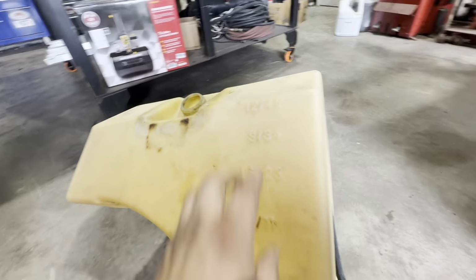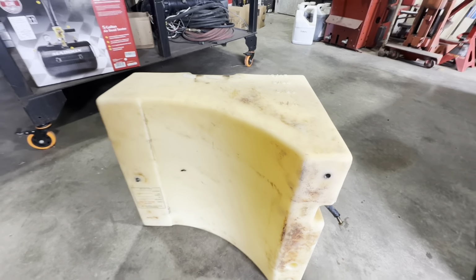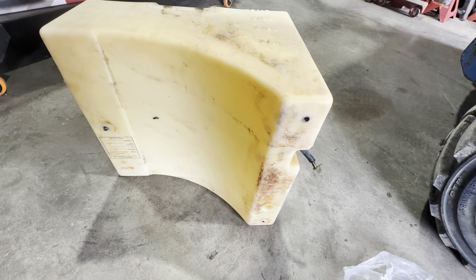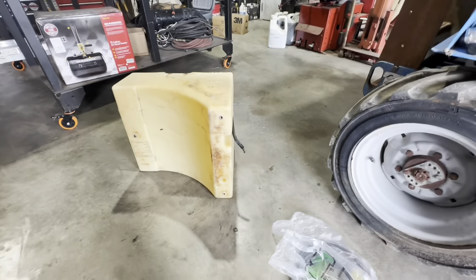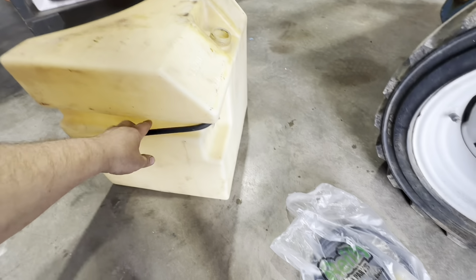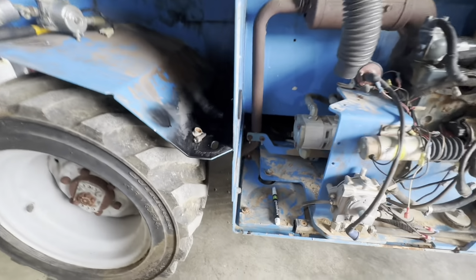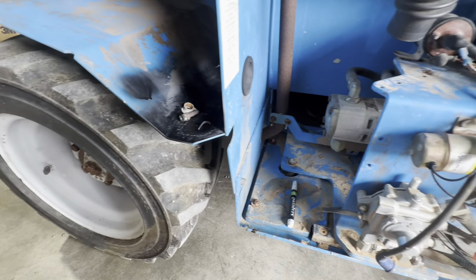And I tried fresh gas, pressure washer, degreaser, all kinds of stuff to clean that varnish out of here, and nothing would break it down. And then I ended up using acetone, and that stuff just dissolved it right away. So that's definitely the way to go. I got some new fuel line from O'Reilly's. Stick that back in, I fixed a little rust down here. Well, I cleaned it up a little bit.